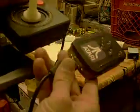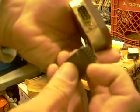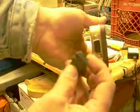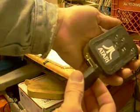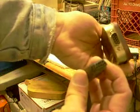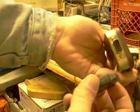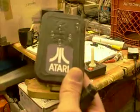Tape, Altoids can, DB9 connector from a parts box — doesn't have to be anything fancy. Fits in there nice and snug. Keep in mind these things have corners that are sharper than a typical serial port and this will cut into it, but it's not a big deal — it shaved a little bit of plastic off the side, but other than that it's a perfect fit. DB9 male. Make sure you get the right pinout — the one at pinouts.ru is incorrect for some reason, or maybe I read it wrong. But this works.